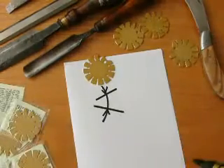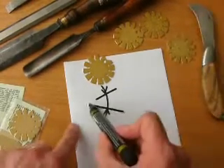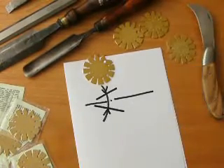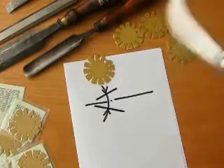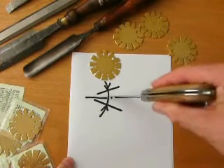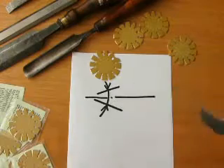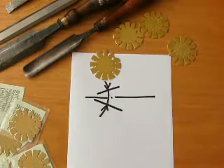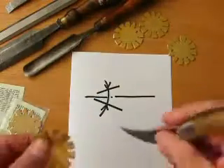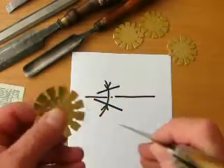That's what we're interested in from the gauge, that's what we're interested in finding out from the blade. And also what matters and is important is the centre line. So that when you put or present the knife to the gauge, it actually is lying correctly, balanced, along the imaginary centre line of the aperture. If that's happening and you've made correct contact with the honed edge, then bingo — you've found the honed angle.